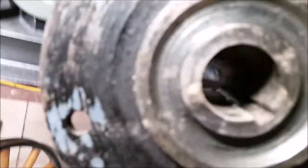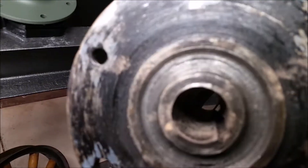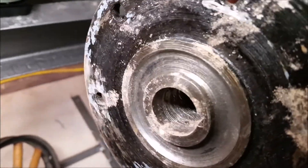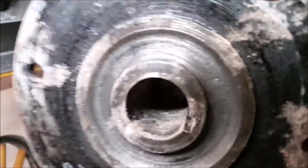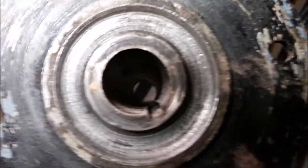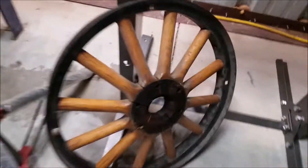You probably can't see too much in there, but it spun on the axle - really got it chewed up inside. It actually sheared the key. I had to take a hammer and peel the key out of the keyway on this one, so it's definitely shot.